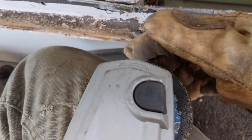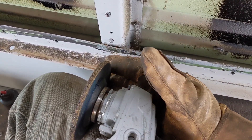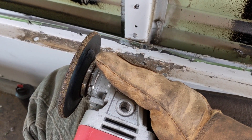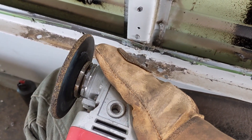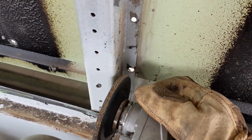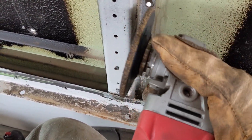The arrow on the grinder shows the blade rotates in one direction, so I cut in that direction — the blade rotates down so it wants to climb up. I have the guard off, which is probably not suitable for a lot of situations, but I like to grab the head of the angle grinder close to the blade. It gives me good control, and if it were to catch and jump, my fingers are clear. You never want your hand above the blade — if it catches and jumps up it'll cut through your glove.